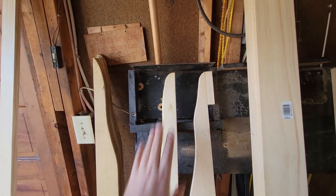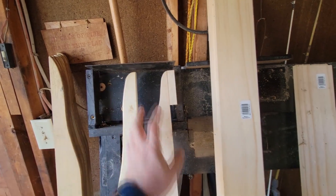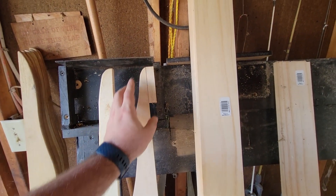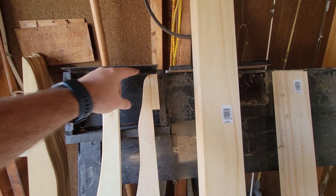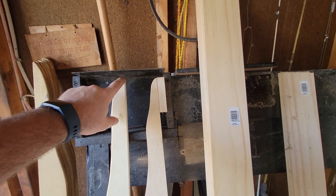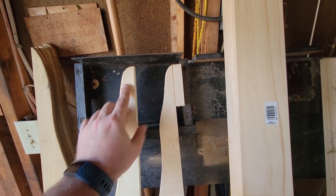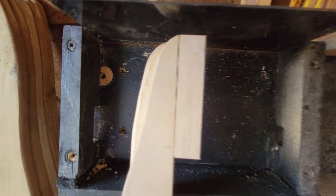Here is what my current stretchers are — obviously this is only half of it. You can see how wide it is. This is what the shape of my new stretchers are going to be, minus this block, which is my router jig. I have this little block on there so when I'm using a follower bit it will follow along and I can follow across the top to make sure I go straight off the end and don't gouge back and mess up the tip. You can see there's quite a bit of difference — in this area here I'm taking off better than a half an inch.